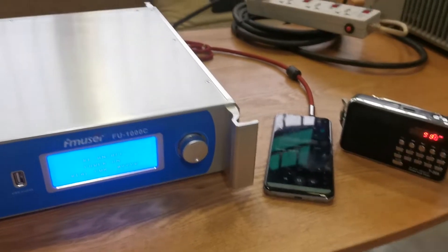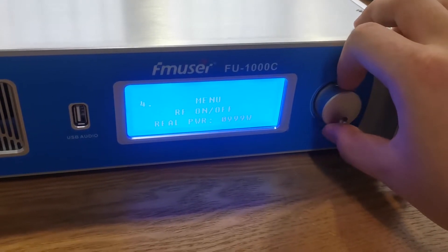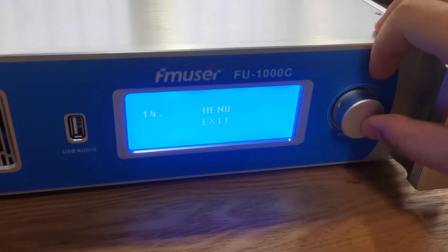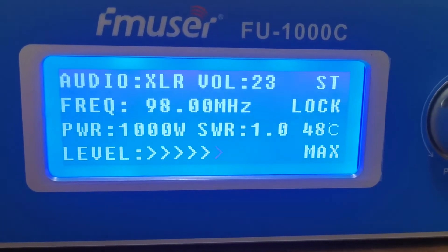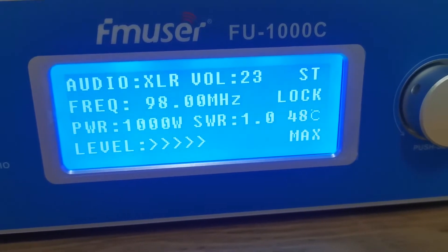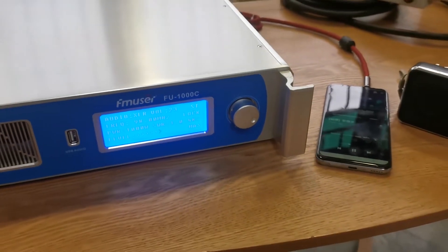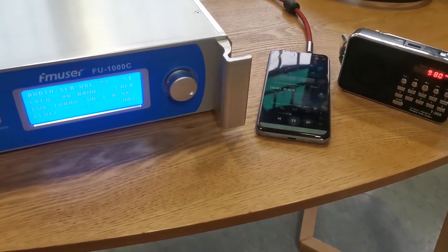The final aspect is to observe whether the radio signals are being transmitted — I like to call it the 10-second waiting. All you have to do is stare at the transmitter main menu for 10 seconds. Make sure the VSWR is below 1.2, and that the music continues to stabilize the output without noise. This indicates that the radio transmitter is working well.